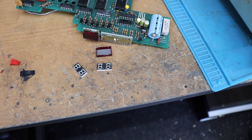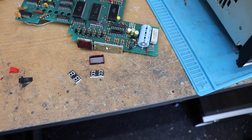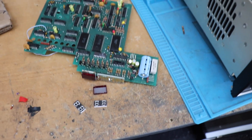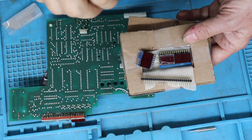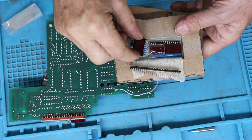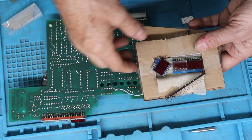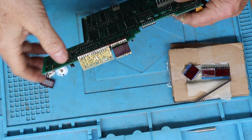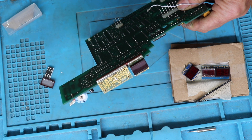I think what's probably happened, as I mentioned, is that these may have already been broken predating the time I got hold of this receiver, and the journey to the eBay buyer probably just dislodged them completely to the state where they weren't working. So what we'll do is try and get this set up so we can solder the new bits onto it. These are the new display parts that we got, and we're going to have to solder those back in. It does come with a little header strip but I don't think we'll need to use that — looking at the board, it's already got a header strip, so we'll just take the old one off and put the new one back on.